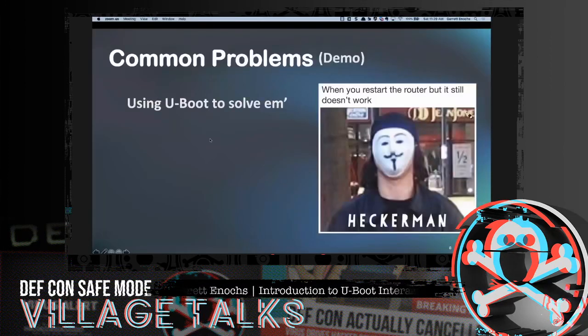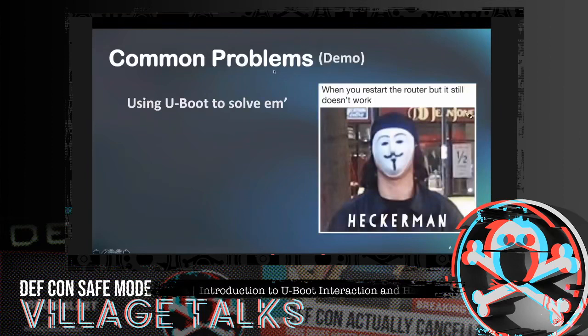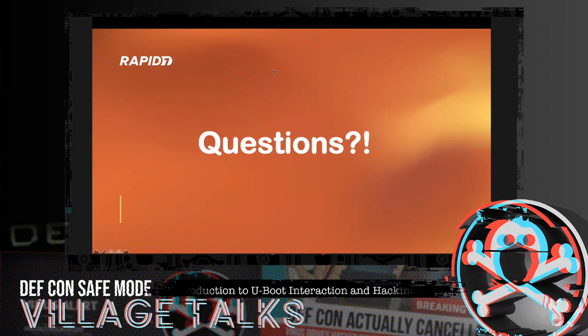Let's see. It looks like there's a couple folks that are helping to troubleshoot, and I saw one of the issues too, I think. It looks like boot args was double set. Also, the board equals appeared to be missing. The boot args, I think for sure, might have been one of them. The board equals might take a little troubleshooting, but that's a couple questions, I guess, that came up. But another. Oh yeah, got it right there. I see it. Yep.